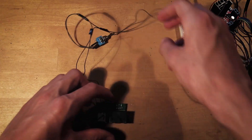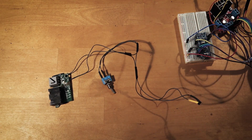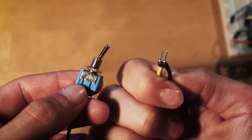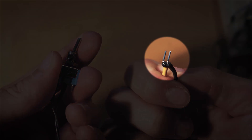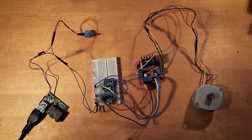So here's what I made: I inserted a switch so we can turn off the power, and if the switch is on and I plug this in, there will be 16 volts between these two pins. I attach it to the microcontroller and the H-bridge, and our motor control system is almost complete — it only requires some programming.